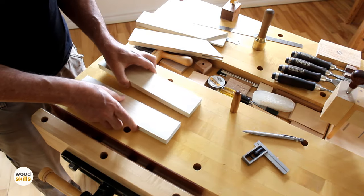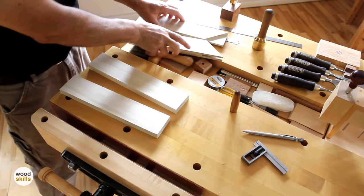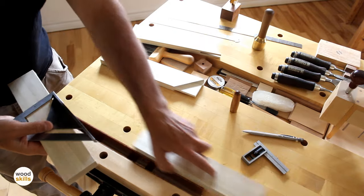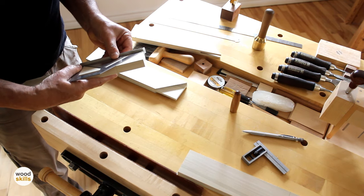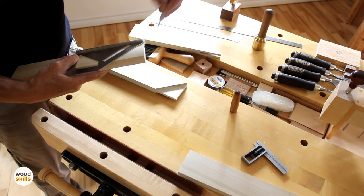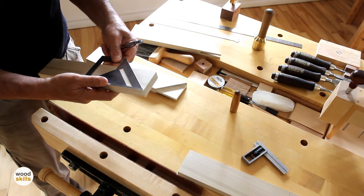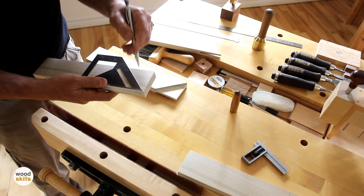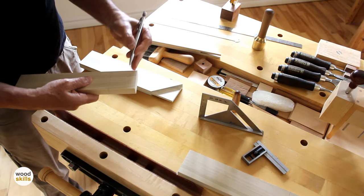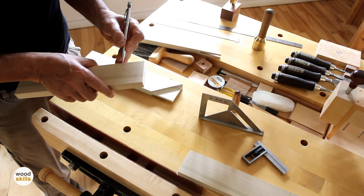Once I've done one component, I use the second component to mark the first one — they're both two and a half inches wide in this case, standard three-quarter inch thickness for this demonstration. I keep my hands against the back as a reference edge to keep it square and mark that off with a pencil line, then carry it around. This gives me a baseline for the joint to work from. Once I have the baseline marked off and penciled in, I work the 45-degree components using a Japanese square, replicating the tenon portion and penciling it in.